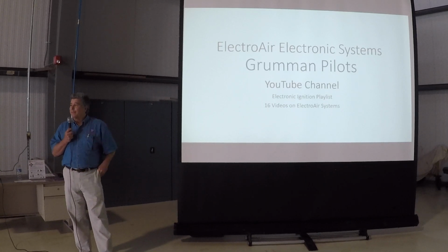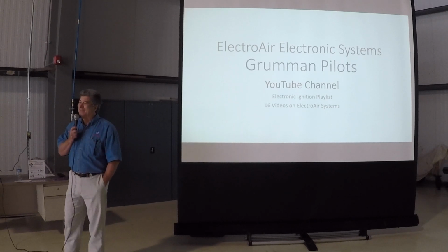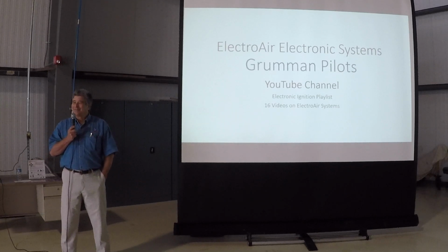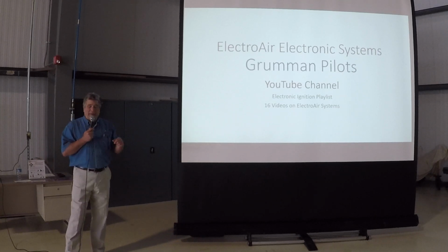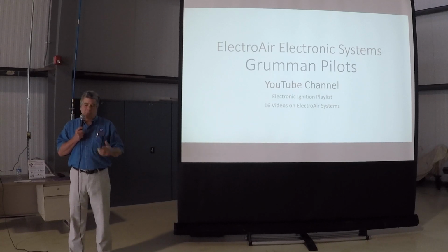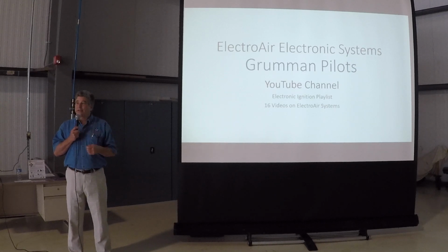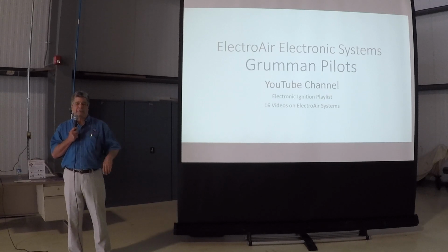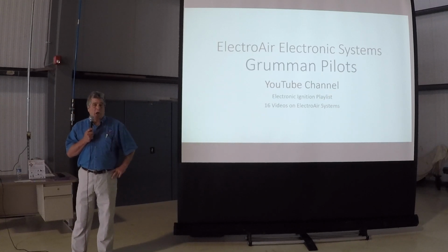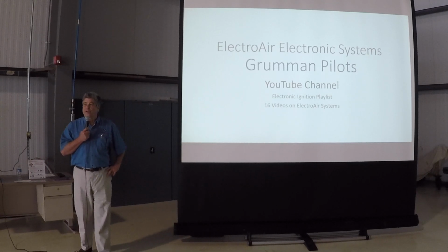Replace the wires. We did have one set of the old wires that failed early. A customer with 54 hours started picking up a miss, and it was only on the electronic side. He brought it to me, we troubleshot it down to the wires, and we checked all the spark plugs. We called ElectroAir, they had a guy coming this way, and they brought us a set of wires. We put them on the airplane. So that's the two warranty issues that I've seen over the last 5 years. Very good warranty service from ElectroAir.